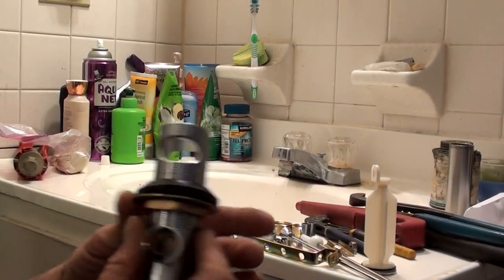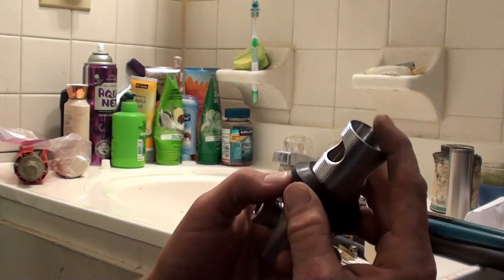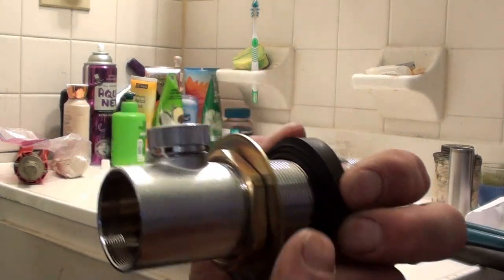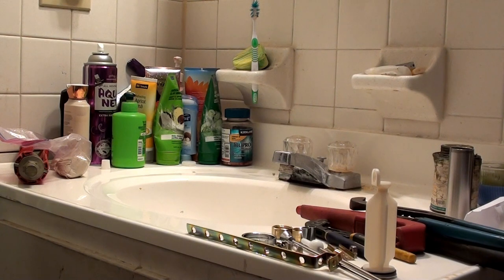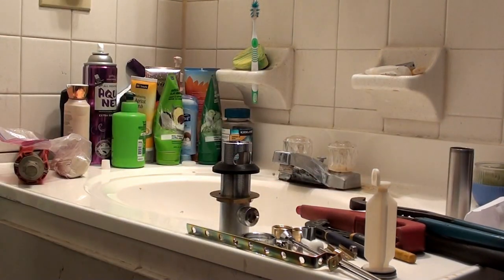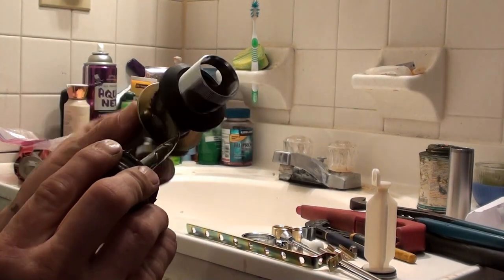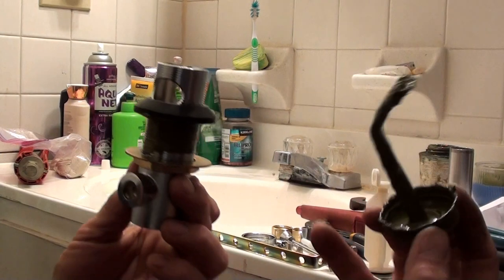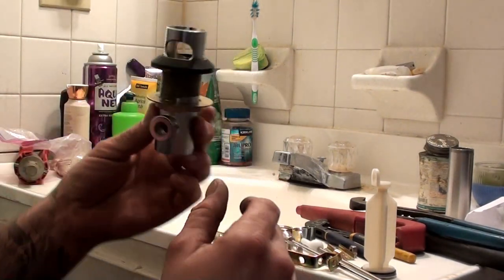On the pop-up assembly, you always take that nut all the way down. This rubber has little ridges that sit down inside the threads, so it would probably seal without putting pipe sealant on it. However, I always suggest putting it in there anyway. Don't use Teflon tape — just use some kind of pipe dope or Teflon paste and put a big bunch of it in there, so that when the rubber smashes against those threads it seals good. I've seen water travel down and around the threads, make it past that rubber and start leaking out.